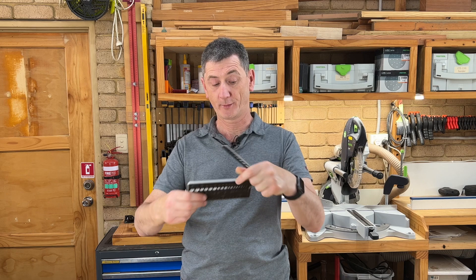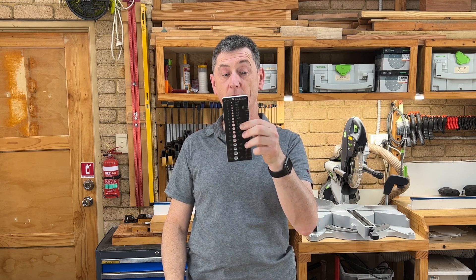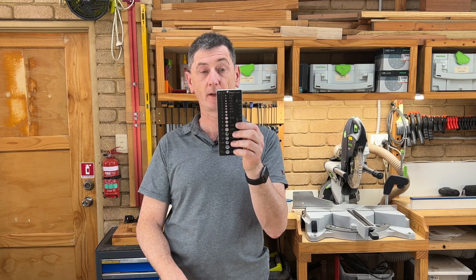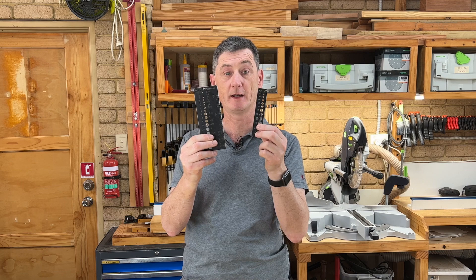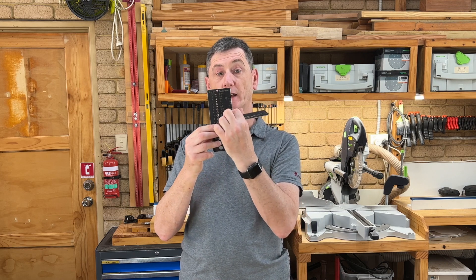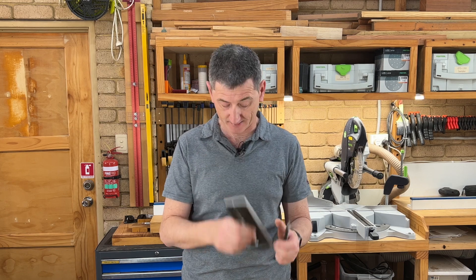Remember that a 3D printer will struggle printing the finer threads around the 3mm mark — you'll need your finest setting, I recommend 0.1mm layer height. There is some tolerance built in but initially it will be tight, so if you've got stringing, clean it out first; a tap is the best way but a bolt will also work. If possible, printing in two-tone is a great idea for readability, but if you can't stop your printer to change filament, you can colour the engravings in with a darker marker on light plastic or a yellow pencil on darker plastic. Thank you for watching — have a great day and I'll catch you in the next video.